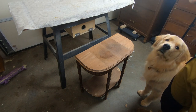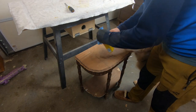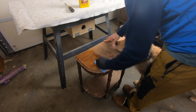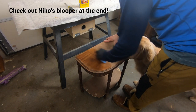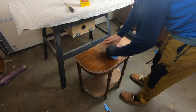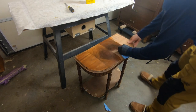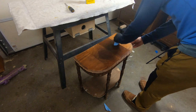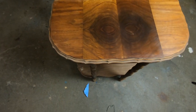This is the next day. I've given about a day for that epoxy to cure on those legs, and Nico and I are out in the garage. We're going to be applying some tung oil to the top of this piece — the tung oil is going to bring out the grain and hopefully really highlight that beautiful book-matched walnut veneer. Quick tip: I like to apply tung oil in very thin coats. The instructions will tell you to leave it puddled for 10 or 20 minutes before wiping off, but I find a much better result using very thin coats every 12 hours. When I'm done I'll have probably four to five coats over three or four days. And you can see right there — that's beautiful grain.